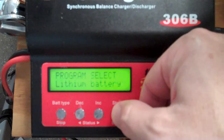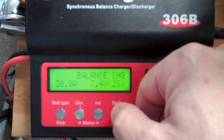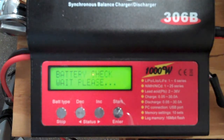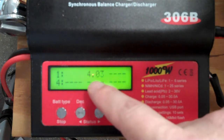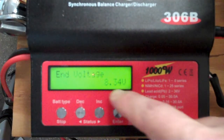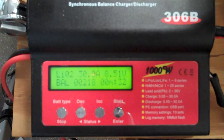I have connected it to a module that should be good. I'm going to change this to LiPo, 30 amps. It's charging at 30 amps. You can see I have 4.08 and 4.03, so these two cells are more in balance. The ending voltage is 8.34 — I think that's 4.17 per cell. Once those get fully charged, we will do a discharge test on that module and see how it goes.